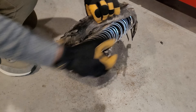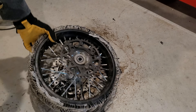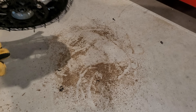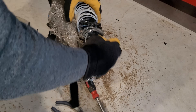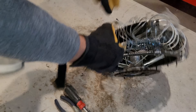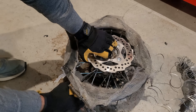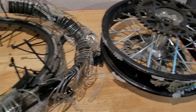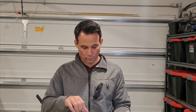At this point you're probably screaming about me using steel instead of nitinol, and you're mostly right. But I do want to point out that the original Lunar Rover tires were actually spring steel. I just didn't include the proper design features like bump stops, and I used a rectangular cross-section slinky instead of a circular cross-section, which really would have helped quite a bit. With smart tires, the key is nitinol's ability to deform and recover far more than steel before yielding — so they can strain a lot with nitinol whereas steel can't come close.